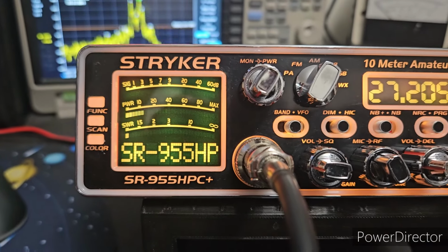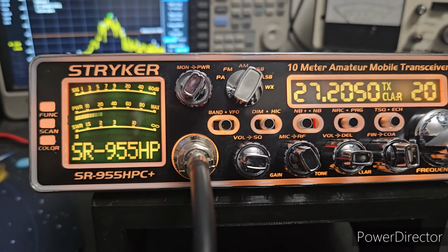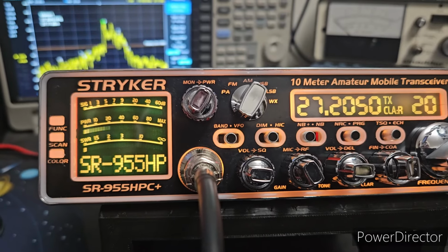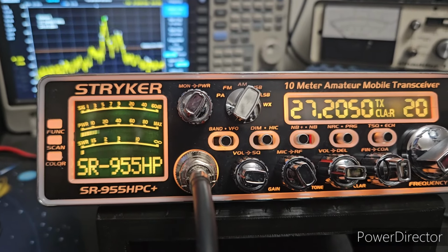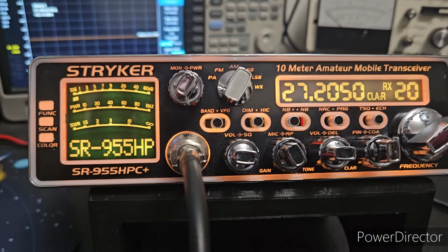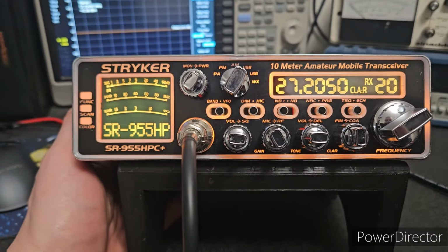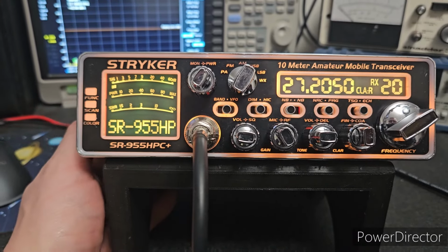That's how these radios have always been when you turn them down and get some cleaner output out of them on sideband. And it's not that I'm turning the power down, I'm turning the third order harmonic distortion out of the radio. Basically, I'm cleaning the signal fully by lowering that number in the service mode by a certain level, and using the spectrum analyzer to tell me what level I see on the third order intercept test. That makes a huge difference. It really does. Your HF radios are going to have that already done because they build those to a certain standard, and these are not so RF clean out of the factory. Plenty of guys would probably use them like that, but I think it's better to do what I do.